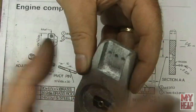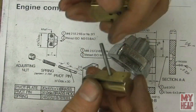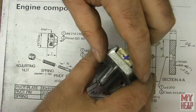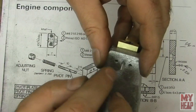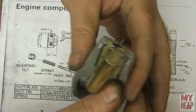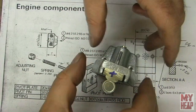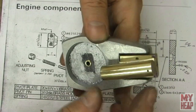I have the three holes drilled into the engine frame. This rod will slide through the face, pivot here, and go through the frame. This block gets bolted to the frame and there should be a clearance hole drilled in the back for the OD of the spring. These will be clearance holes for the 5-40 screws or studs that hold this in. I was advised it's better to use studs because once this is all assembled onto the main engine frame you can't get nuts in there.